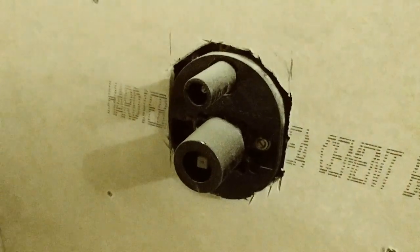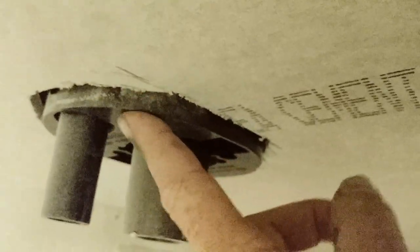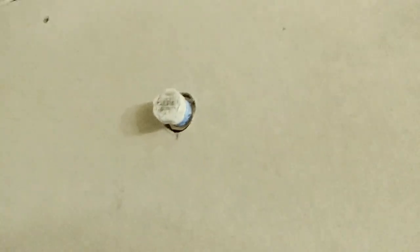Cut out the hole for the nook, which should have been done before actually, but get your valve. Flush with the finished tile, so we left a little extra space there. Got your handheld, got your shower head. Put a coat of spackle on the ceiling. That's going to have to be painted before we tile up to it, as well as this corner has to be painted.